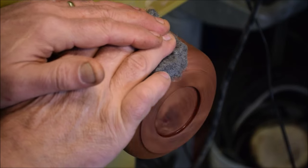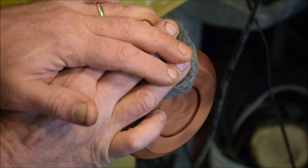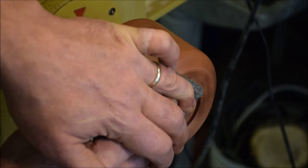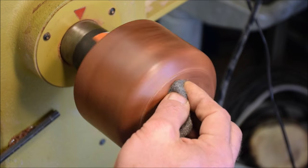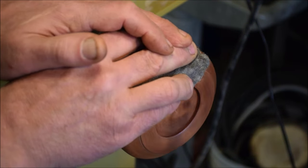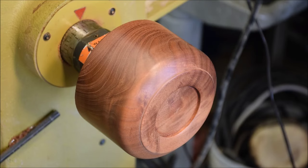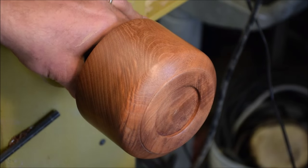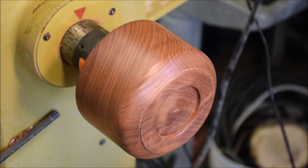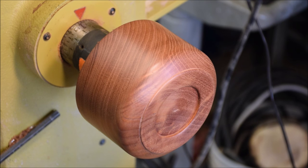For a little de-nibbing — spinning slow — I'm taking a little wire wool. This is quadruple-aught, or ultra-fine wire wool. A lot of the time I don't like to use this on open grain, real open grain woods, because you can get little bits and pieces of the wire wool down in there which will oxidize and turn blue or black over time. So most of the time I just go ahead and do the wet dry paper — you run less of a risk of having bluing or anything like that.